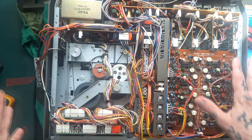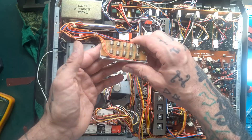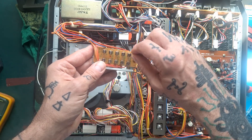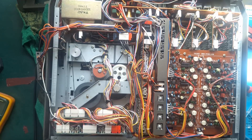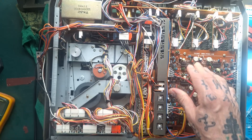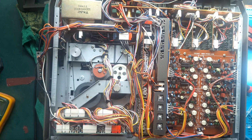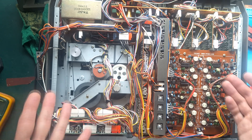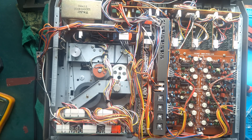I alluded at the beginning to a method where, supposing all the boards are out and exposed — either we have the US market model without this fuse board or we run a jumper over the fuse socket — we actually allow whatever is causing the short to ground to heat up. Then you spray cold spray on each board in turn and see if there's a spot where the cold condensation heats up and disappears faster. That's a way to find where the board's getting really hot without buying an expensive heat-sensitive camera, though those are a couple of hundred quid for a good one — a lot of money for something you'd only use once in a blue moon. I'll probably buy one eventually since I'm doing this for a living now, but I haven't reached that stage yet.